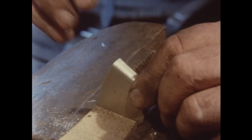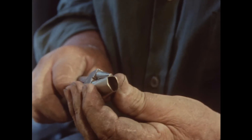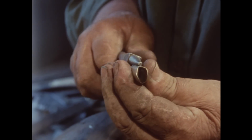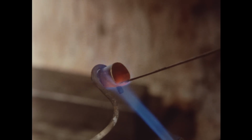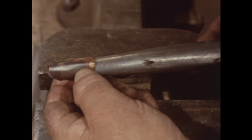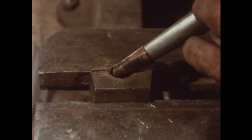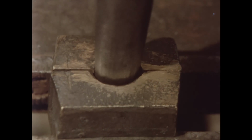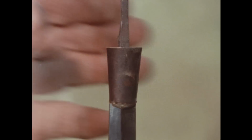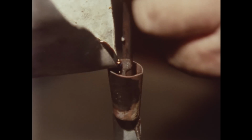Knives and sheaths worn as part of the dress have of old been decorated with fittings. The lower fittings are made of a thin, flat piece of German silver and soldered with silver. The fittings of the knife and the sheath are usually made of the same metal. On Kauhava sheath knives, the fittings are of German silver or brass. The fittings get their exact form in the mould. They are then fixed on the shaft with liquid brimstone.